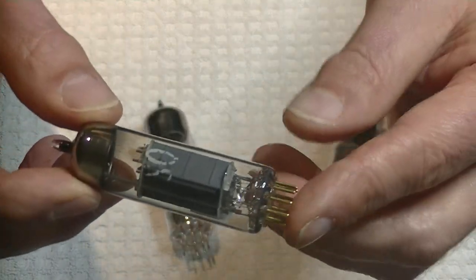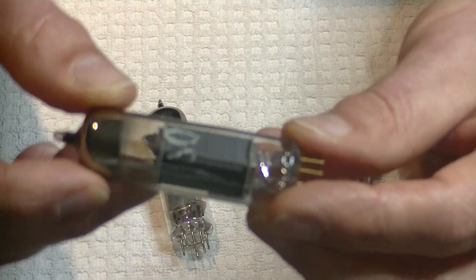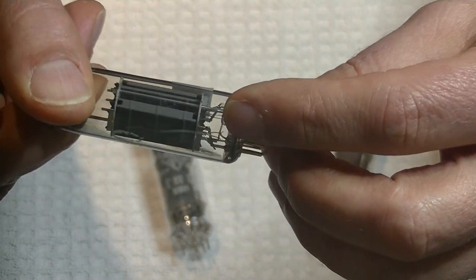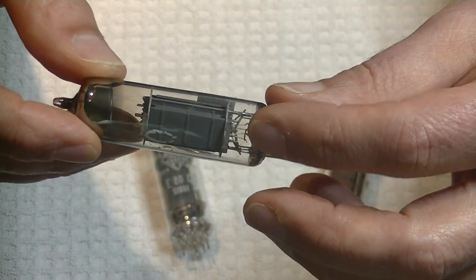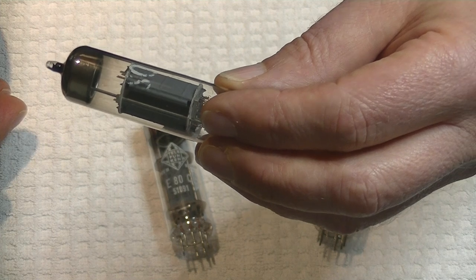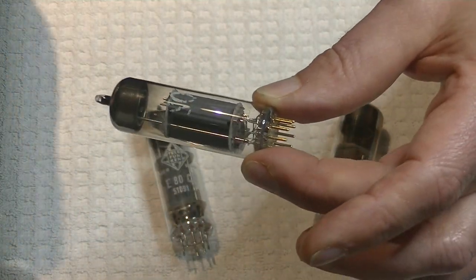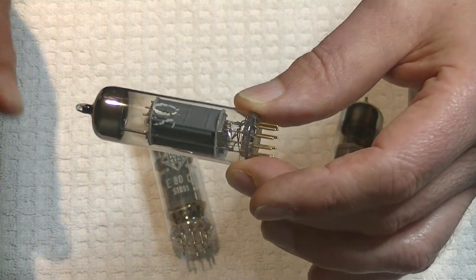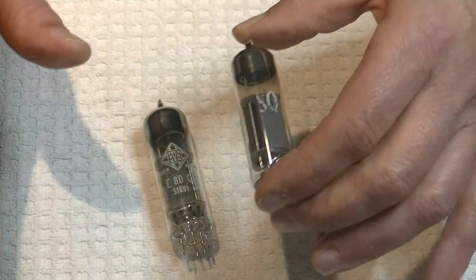And here is the real deal - this is the special quality gold pin version. How do we tell the difference? There are no holes on the side. And if we look carefully, we should see etched at the base of all Philips tubes the factory codes. Sometimes they rub off, they're very faint, and sometimes they didn't put them on. But in most cases you'll see two lines of etching. All Philips companies including Mullard used these. The two main brands were Philips and Mullard, and the brand names were Bugle Boy and MiniWatt.